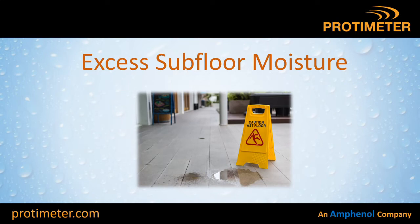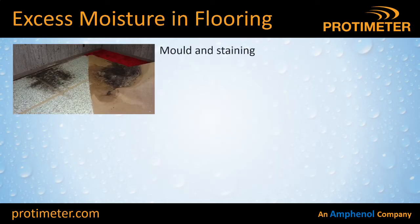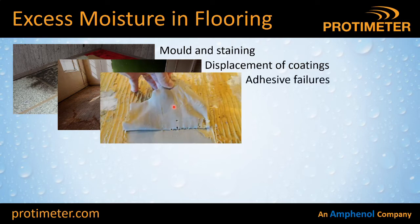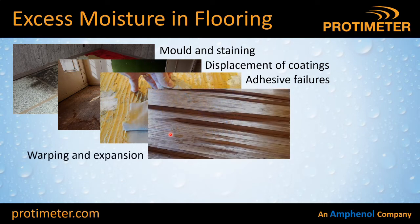When I say flooring, I actually mean sub-flooring — this is all about measuring the moisture or excess moisture in subfloors. First of all, let's take a look at what happens when you have excess moisture in subfloors. In this example, we've got some mold and staining, and here with wood the moisture can come up from underneath and actually lift the coating — either a wax or varnish — off the wood. You can see it's caused a white emulsion finish which has really destroyed the flooring finish. Adhesives can fail as well: if the moisture comes up underneath the adhesive it can attack the interface between the adhesive and the cement below and make it loose.